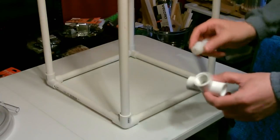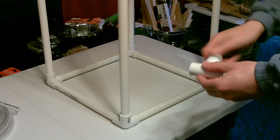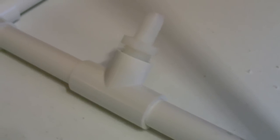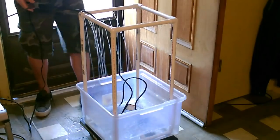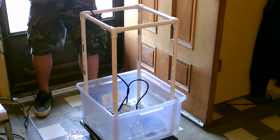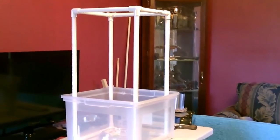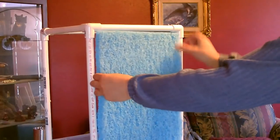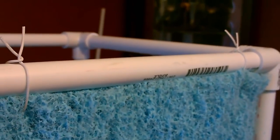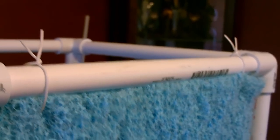To add the pump, just take a tee and a plastic hose barb, screw it together, and cut a section and drop it on. Just to see how it works, add some water and do a quick experiment. Now to add the pads: take some plain thin wire — I'm using the coated stuff — work it through and twist it off. Do four total per post.